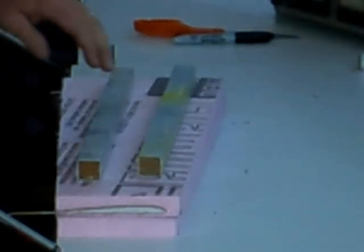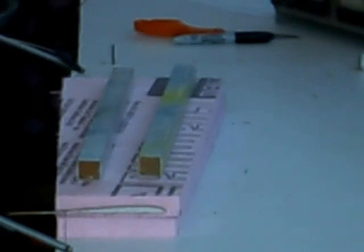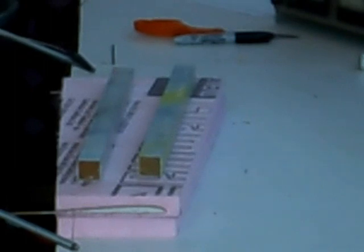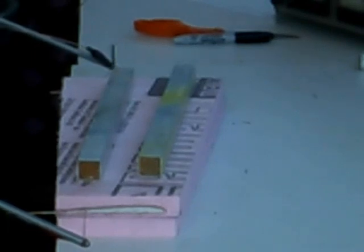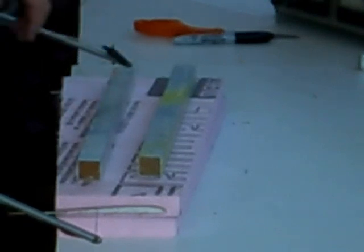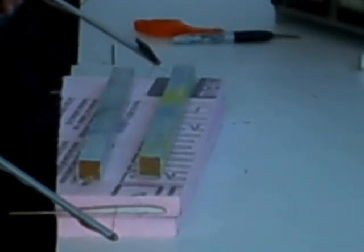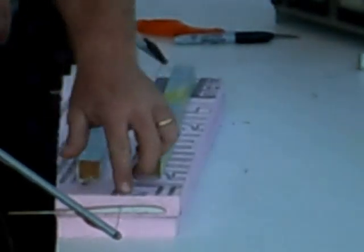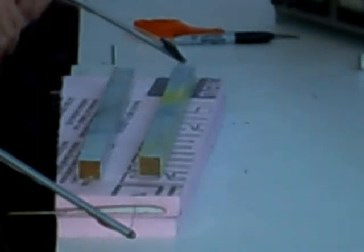I went ahead and started my wire, trying to keep it even. I'm just going to keep even pressure on it — I will have to go faster on this side. Once I start cutting it will change your temperature of the cut and it will change your airfoil. I'm going a little bit slower on this side and keeping a little bit more pressure. I usually keep the bow at about 40 degrees. Right now it's pretty easy to keep that constant pressure down on your template.